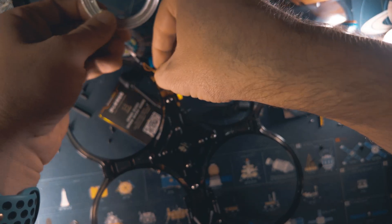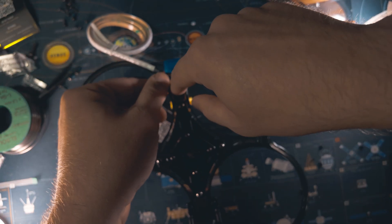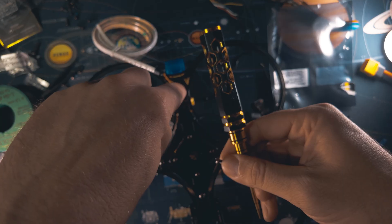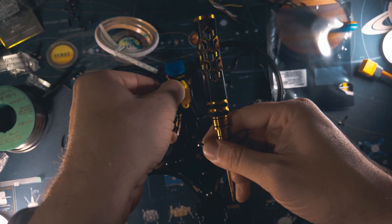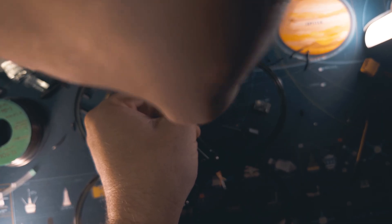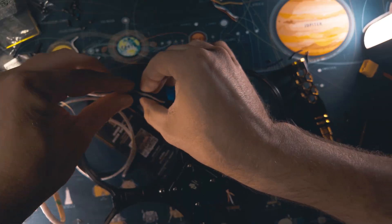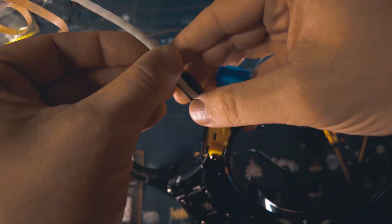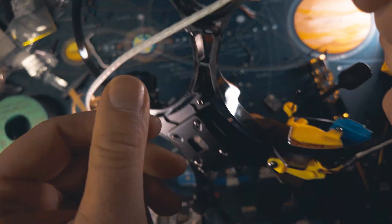We fiddle the wiring kit through the hole, which is not that easy. Afterwards we push it to the edge of the frame, and then there is a little TPU piece that comes on top of the PCB and is mounted with two screws. The next fun part of the drone build starts — you have to push the LED band through the frame. There's a little gap and you need to move it all along the whole body of the drone. This will take some time, but you will get it sorted.